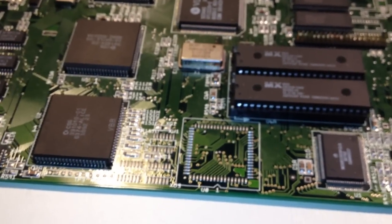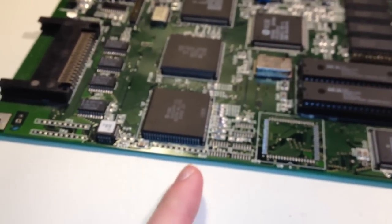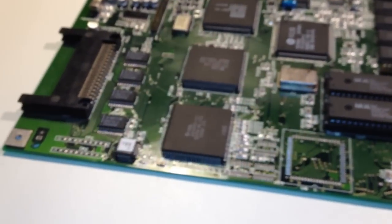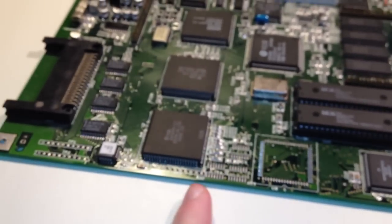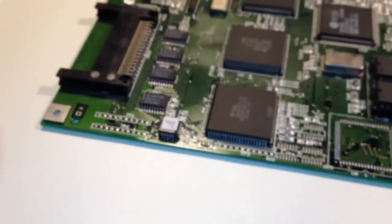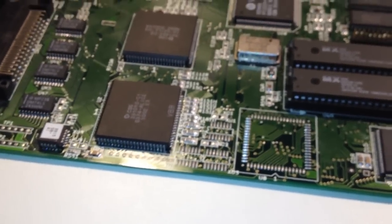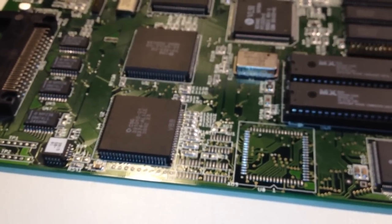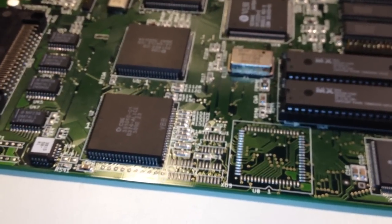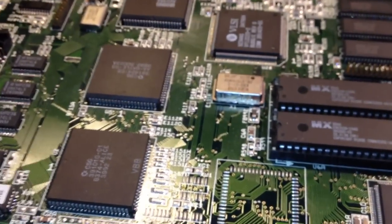Okay, so when we were looking on the scope, what signals were only switching in the middle, where we have that problem? I could see 2 of those data bits that were switching only in the middle, and not here and not here. They were only switching in the middle, not at another place during the course of the slide bar. Could you see which 2 data bits those were? Well, if you didn't notice, then maybe you can rewind the video a little bit and have a look again. We will get back to that soon, but for now, I will show you the other way I mentioned, another method of troubleshooting this, that I thought was easier.